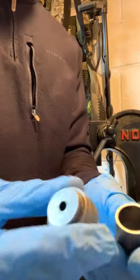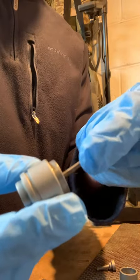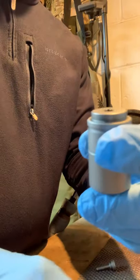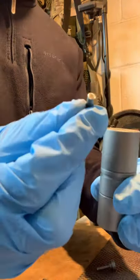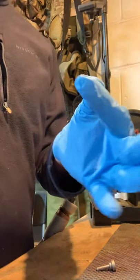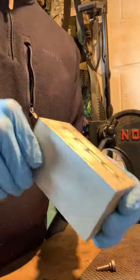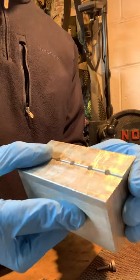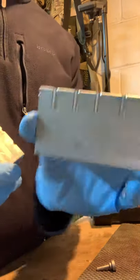With the die, simply place — put the dimple in the bottom, then push that on, and you've got basically the lid type thing so it's ready. Just need to put some lead in. Just lead blanks, easy to make. You can buy lead wire 4.5mm — this is for 2.2. You can cast your own. I've got two aluminium blocks approximately 100mm long, just clamp them together, drill five holes at 4.5mm roughly, then give them a quick polish and you're left with that.